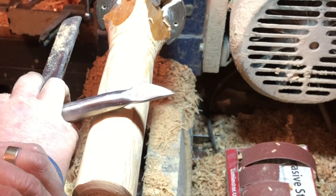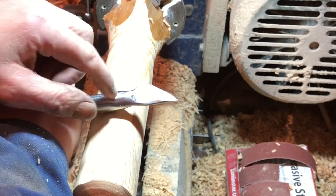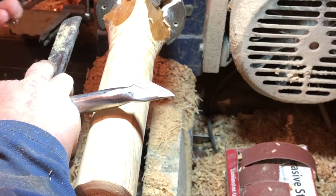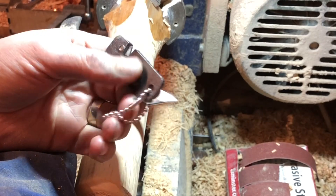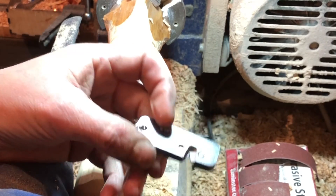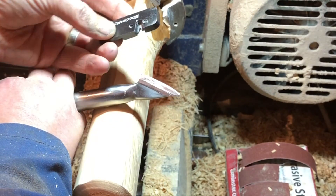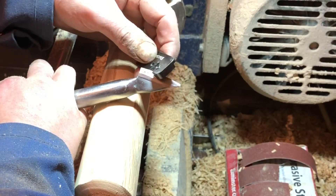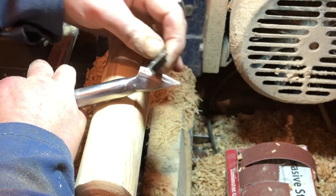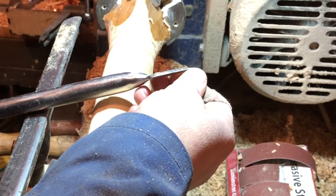A lot of people have asked about the sharpening of these things and how long the blade is going to last — if you keep sharpening it, it's going to be left down to nothing. A video I put out the other day is to avoid using your angle grinder and even your CBN wheels to sharpen these things. Just use a kitchen knife sharpener. These are particularly brilliant — they've got a couple of little carbide blades in there and they put a nice fresh edge on your blade. You get a razor sharp edge.